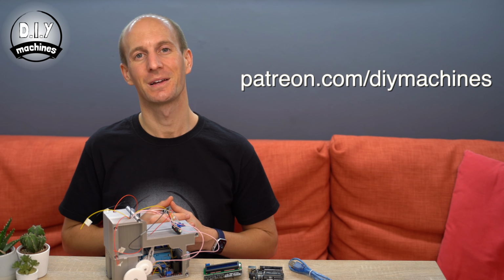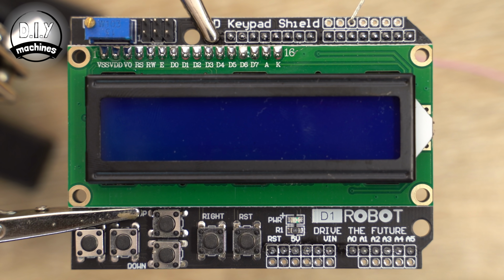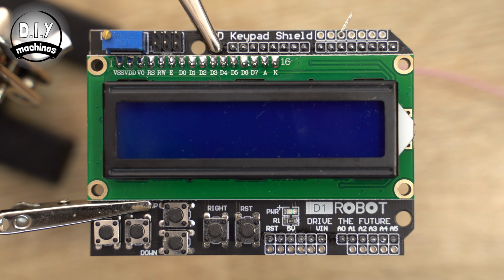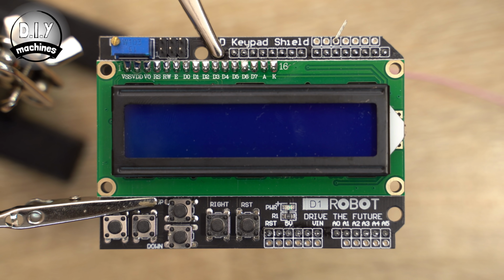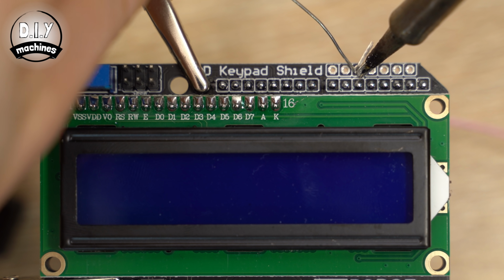So, if you take your LCD display and warm up your soldering iron, we can begin to add the wires. Starting at the top, from left to right, we want to first connect the signal wire coming from our steering servo, I marked mine with 2 rings earlier, to the 3rd hole along.